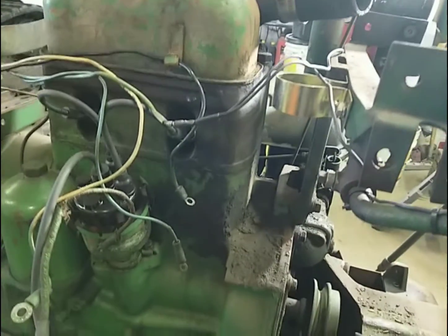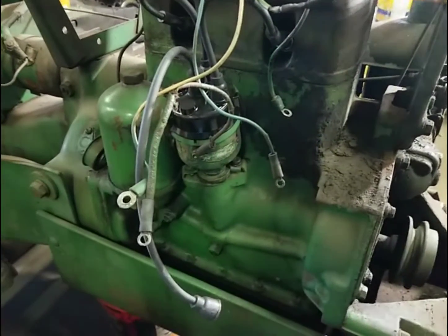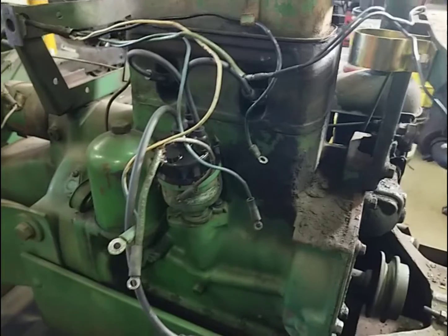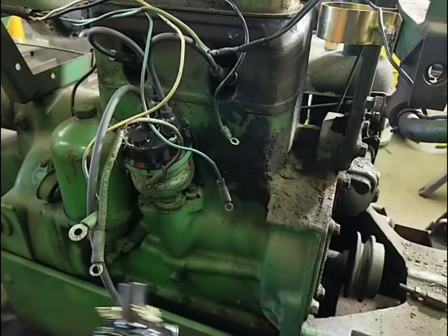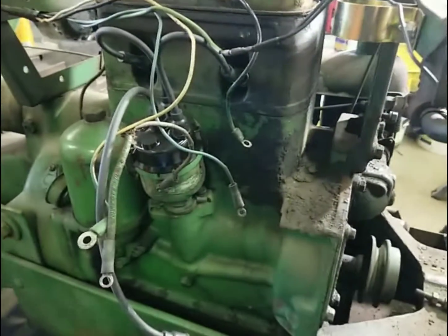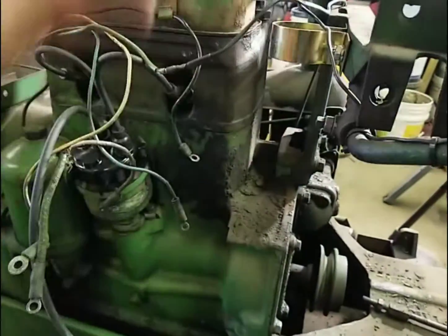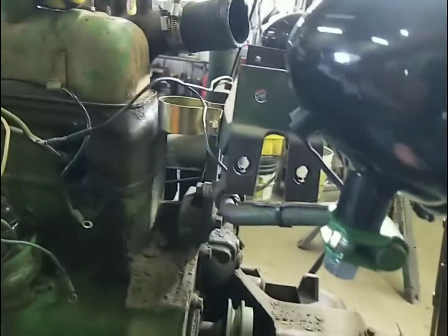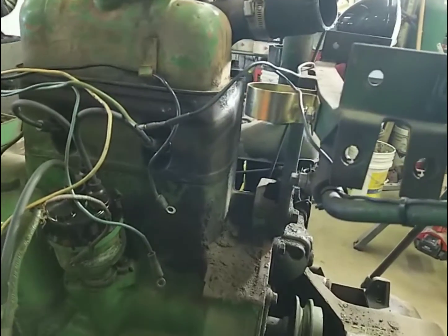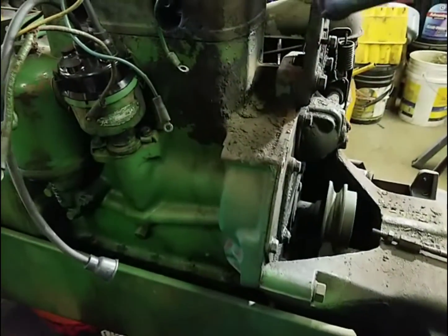Okay, so I got the coil all off out of the way. It's off completely. Gonna lay it to the side. We'll use that for another project. Maybe if I get another I need a 6 volt coil, I'll use it on it. But I realized that the coil bracket's the same. They're all universal. So I just decided to back the Phillips screw out a little bit, loosen it up, and drop the coil out. And I'll just leave that on there and put this bolt back in, so I don't have to mess with unbolting the lights or anything like that. So when we're ready, I'll just slip the new coil in there, tighten that screw up, hook the wires up, of course, and we're ready to go. So I'm going to get all the brackets gathered up, and we'll get the alternator on.